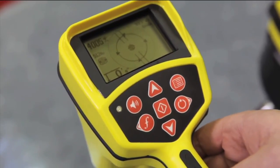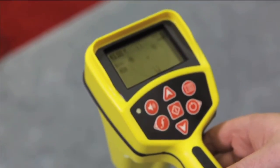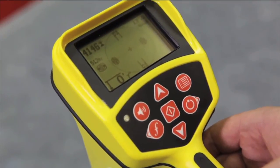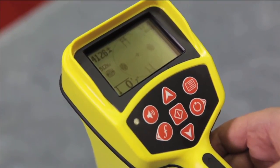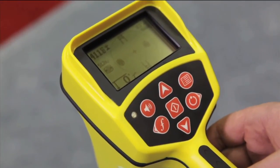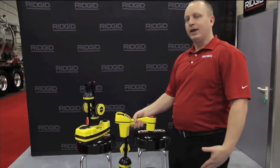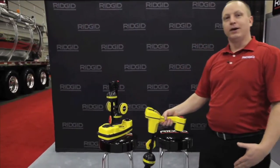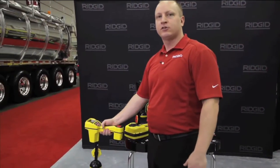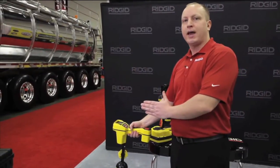The pole is not our camera source — that is the edge of our signal. As we get all the way to the highest reading possible, we see what we call the equator line. The equator line is going to run perpendicular to the direction of the pipe. We also have a real-time depth reading. I am now 7 inches from my bottom antenna to the source of the camera head. The higher the number, I'm getting warmer; the lower the number, I'm getting colder. As I use that number to get to my camera head, the information displayed on the screen will pinpoint the location and give me real-time depth and direction of the camera and the pipe underground.